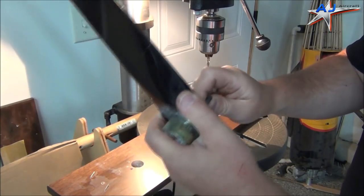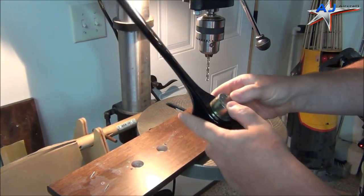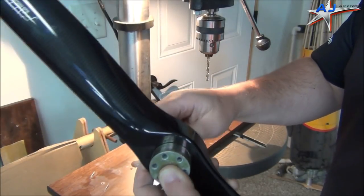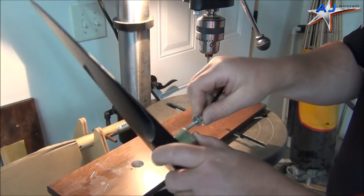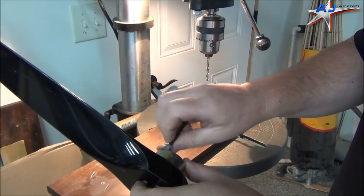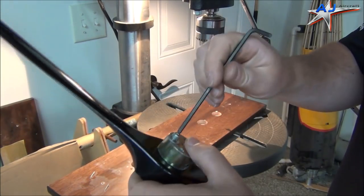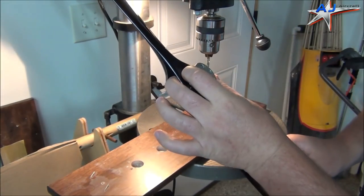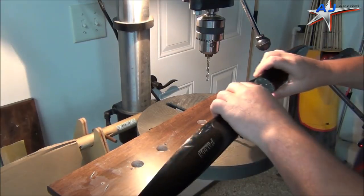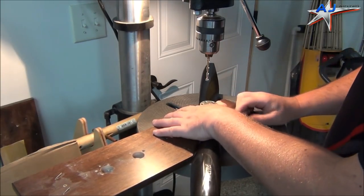So we're going to go ahead and take the jig off and flip it around to the front side of the prop — there are our drill holes. Just by eye, I'm going to line up the hole that we drilled all the way through. You can use a prop bolt — obviously you don't have to do it by eye. You could use a prop bolt, which is the same size as this, and push that in. My bit's getting a little bit dull — it kind of flared out my hole on the exit there a little bit. But if you want to, you can insert a prop bolt there and then put your bolt back on the jig and double check it. So now we're going to re-pass through the one that we drilled all the way through, and then continue drilling all the rest of them all the way through as well.